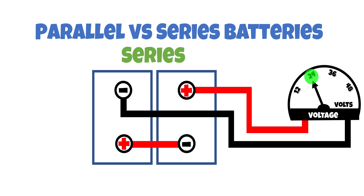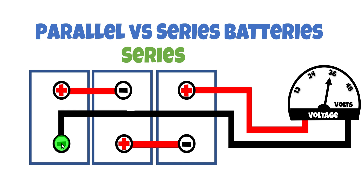Adding a third battery in series — moving the negative again to the negative of the third battery and connecting its positive to the negative of the second — gives us 36 volts. But there's no such thing as a free lunch. Even though we've got 36 volts, where parallel gave us 300 amp hours, in series it's only 100 amp hours total. So we've got 36 volts and 100 amp hours — that's how series works, and it gives us enough voltage to actually make an arc.